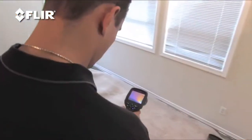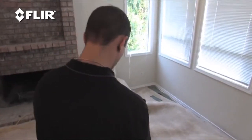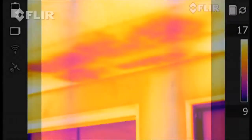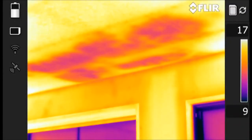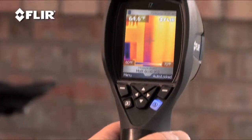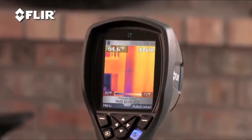When the room is pretty much dried out, take time to look around for anything you might have missed and also to find other potential problems. For example, in this area you can see the studs in the wall. These dark points here are actually drywall screws. This looks like some of the insulation may have sagged — maybe from getting wet, or perhaps it was poorly installed from the start. The insulation is completely missing here. This place could use some improvements.